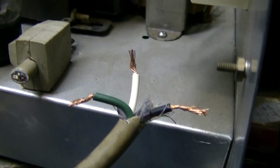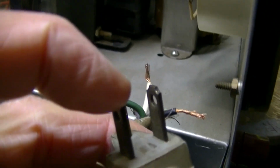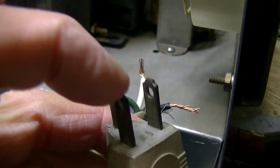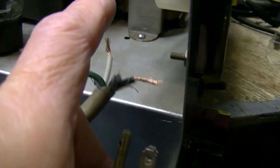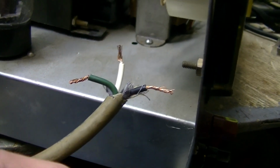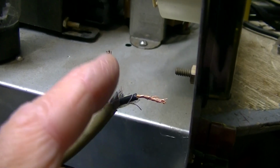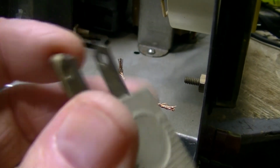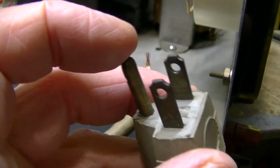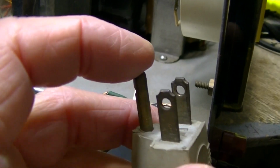And you're asking why the plug is off? Well, come to find out, the neutral, when I put a continuity check from this pin here to the neutral wire at the other end of this cord, where it goes into the power supply, I was getting intermittent readings, anywhere from 20-some ohms down to a half ohm when I wiggled this pin. This is the neutral side right here. The hot side was okay, and the ground was completely all the way through.